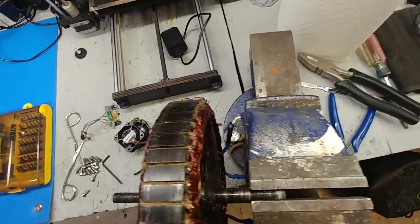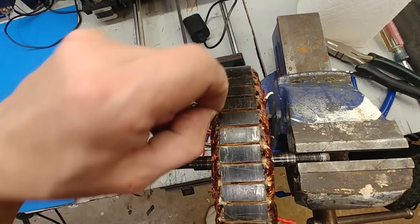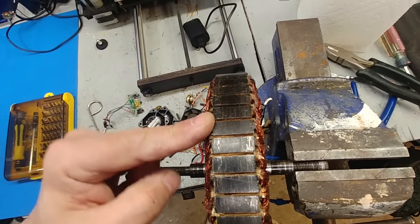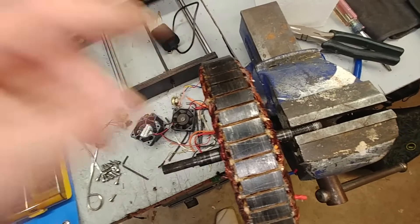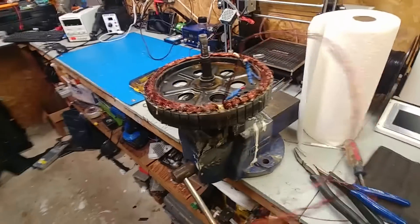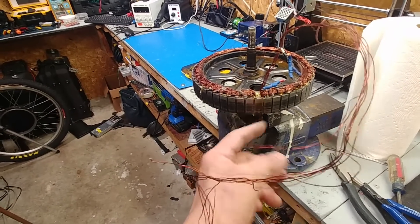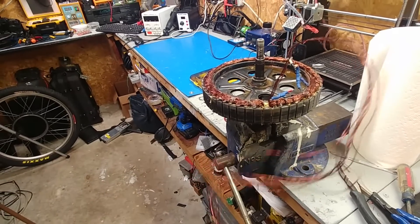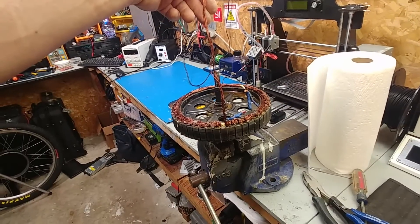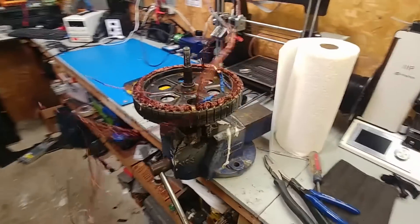All those slot retainers do is - after they finish winding, they fold over the insulator paper or plastic, then slide that piece in to keep the paper and wire from popping out of the slot in motion. This is going to take a long time - I'm going to end up cutting all the copper and pulling it out, literally chiseling the stuff out of the slots. I managed to get five to six turns per pole, so I'll go with five or six. I'll get that documented and we'll write it down.